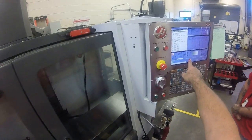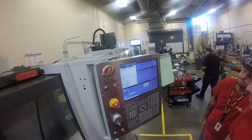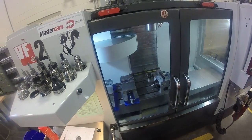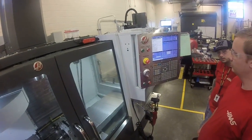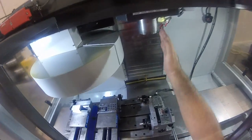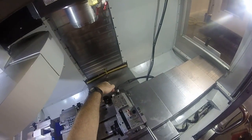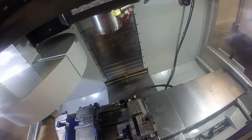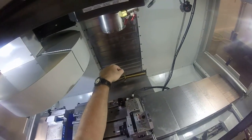Because we're running four axes now. Next thing we'll do is turn the light on. So now we're ready to do our work for the day or do a setup. This is our home position right here at about this coordinate. Somebody told me a long time ago to think of yourself as the spindle when thinking about movement — don't think about the table movement. Imagine the spindle is moving: this will be X negative direction, this will be Y negative direction. So this is your home position.